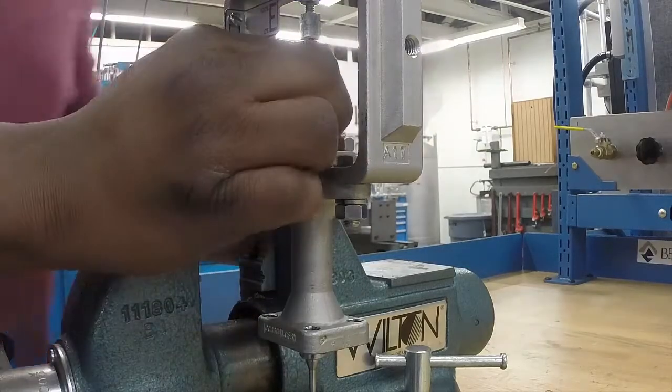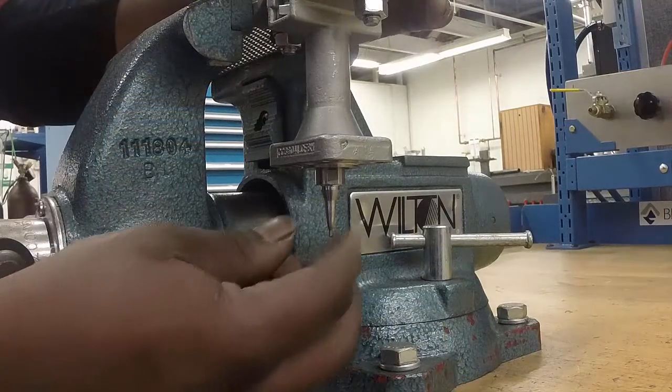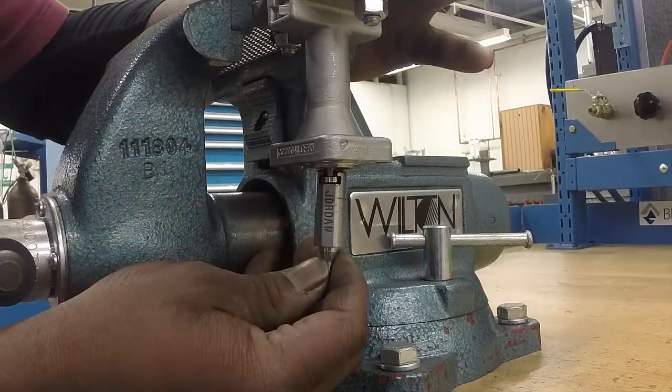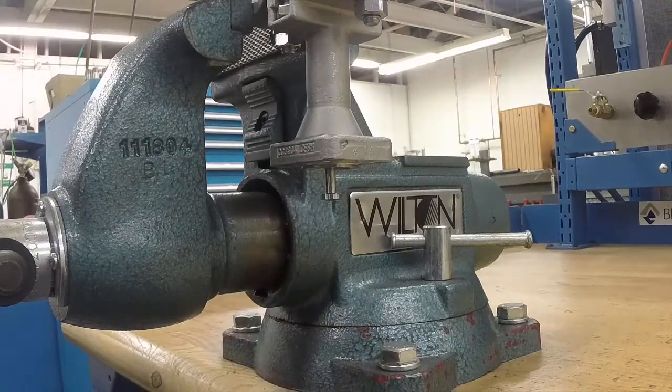On valves with CVs of 0.05 and larger, this will allow the stem to drop low enough to remove the plug. If you are not replacing the packing, make sure the stem threads do not enter the packing box, as this can damage the packing set. For CVs of 0.02 and smaller, the stem and plug are one piece and can be removed through the top of the packing box after removing the yoke from the bonnet.